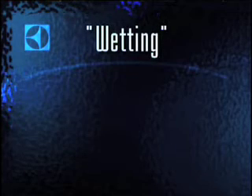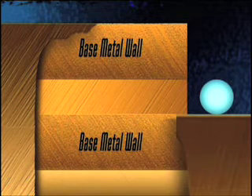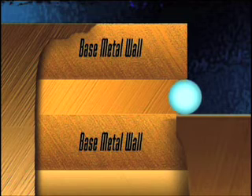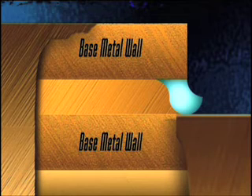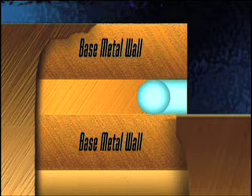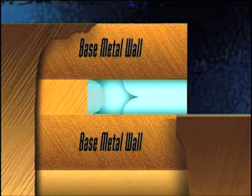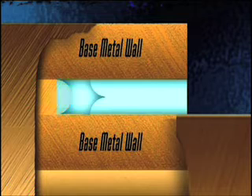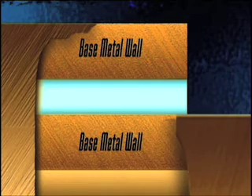Capillary attraction depends on wetting to pave the way into the joint. Wetting is how the filler metal moves through the joint. A molten drop of filler metal takes the shape of a drop because the molecules within the alloy are attracted to each other, but they have a stronger attraction to the base metals being joined. As the filler metal enters a joint, the natural curve is broken as the alloy is first attracted to one wall — this is called wetting. The opposite wall is then wet, and the filler metal reforms its natural curve, continuing along the joint. If the metals are not properly cleaned or are overheated, wetting may not occur and capillary attraction is lost.